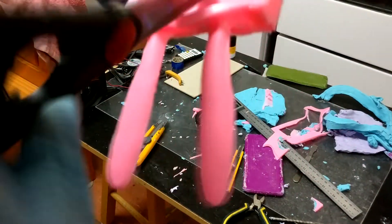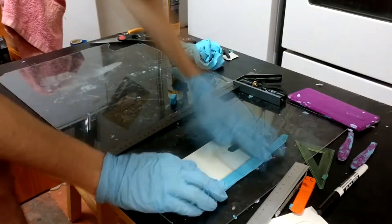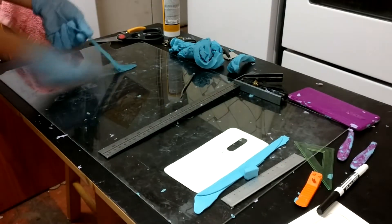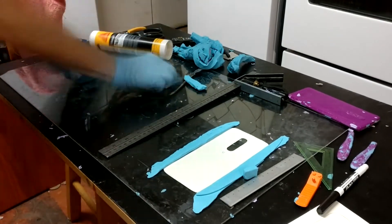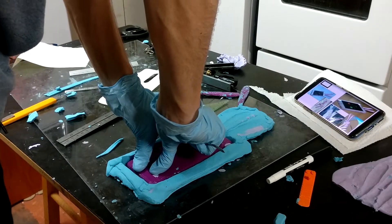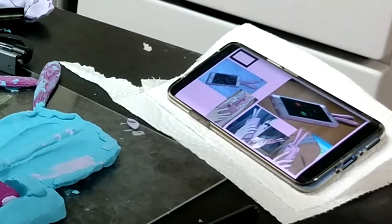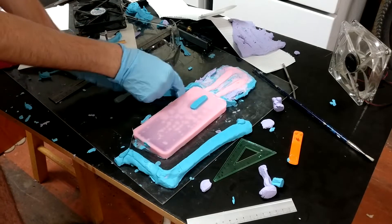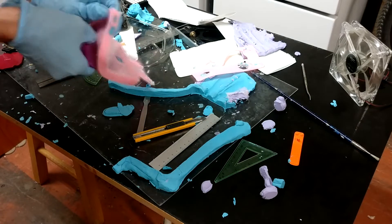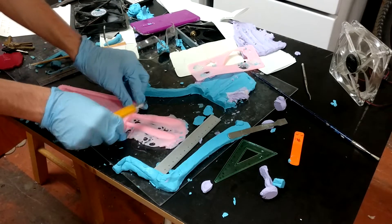So I had a plan: all I need to do is make the ultimate mold to cast this next one in. For this mold I pulled out all the stops. I made sure it was exactly level, made the edges perfectly straight, cut a piece of paper in the exact size I wanted the phone case to be, and made a placeholder for the charging and camera holes so I wouldn't have to cut them out. I made the background the average color between several shots of my phone case just to make sure the color was spot on. This was gonna be it. And it still wasn't perfect — there were still bubble holes in the ears, and I had to do some cutting to make the camera and portholes bigger, which made it look pretty bad from the outside. I also messed up cutting some of the sprue from the ears, which accidentally made one shorter than the other.